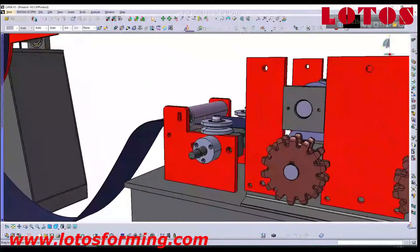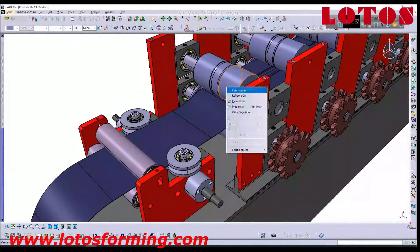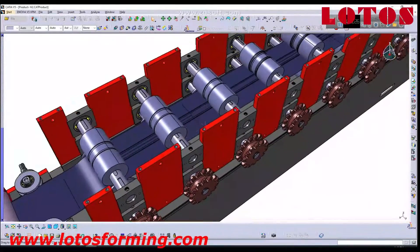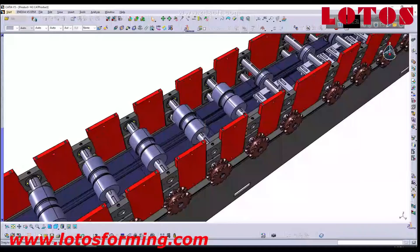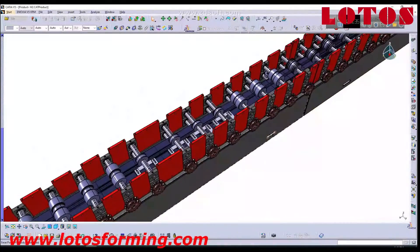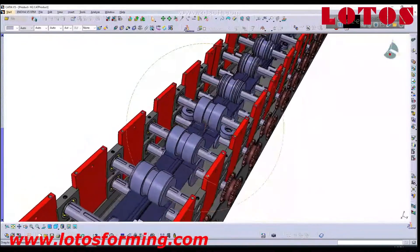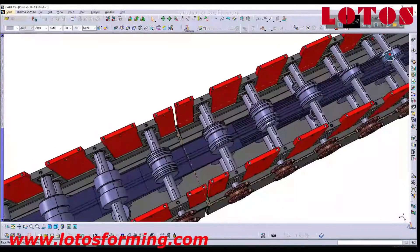I will show you the shaft roller — up roller and down roller. Going from the top, one by one, I show you how we shape the locking form. Up to station 14 we show you the locking feature, then from there we start to bend both sides. As you can see, both sides start to bend, and we go forward to finish the U-shape.